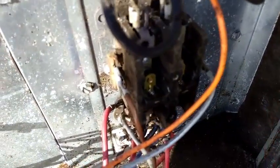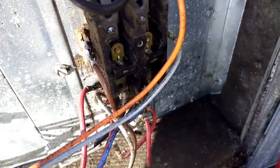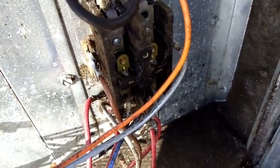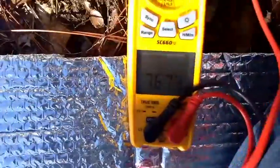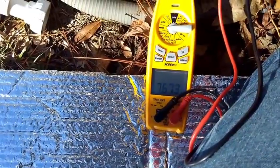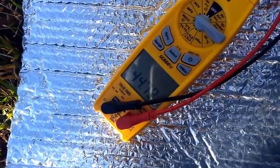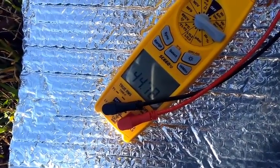The contacts don't look too awful — they've got some wear on them, some carbon buildup and all that. Probably another season on them; we could swap them out next year, maybe even the year after, depending on how they look on the next check. We'll test our first capacitor — I want a 7.6, so we're good to go there. And the 45 microfarad capacitor is reading 44-point-something, so we're good to go there as well.